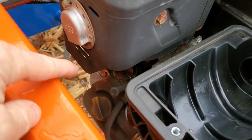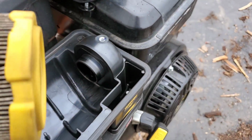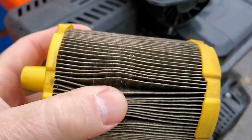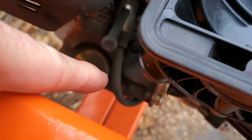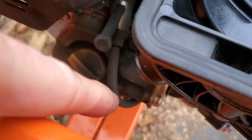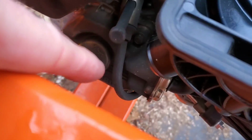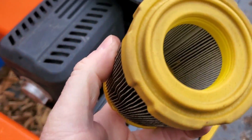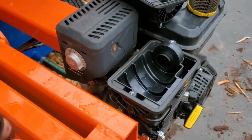The exhaust is blowing and the engine's sucking it right back up into it. And here you've got a majorly gummed up air filter. And I think too, the spark plug wire has like this protective sheath that goes on it, and I think it was being abused enough that it's sucking all those fibers that are getting blown off of it into the air filter. So this air filter was in really bad shape. So I'll turn this around again here.